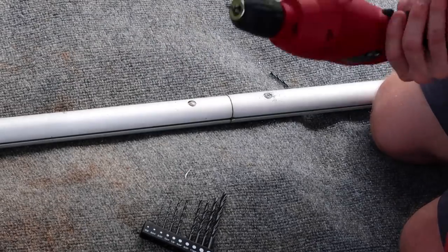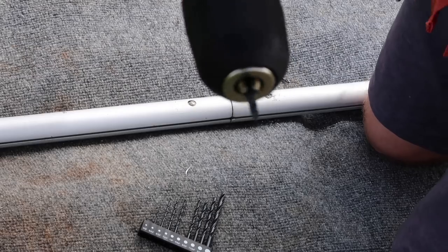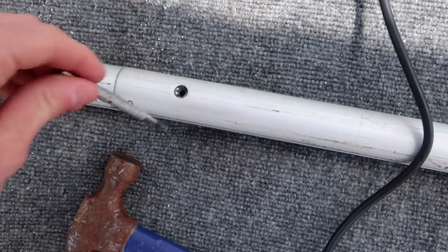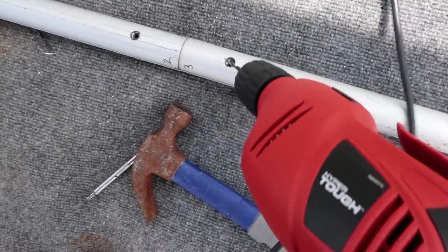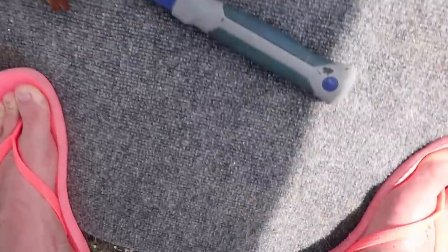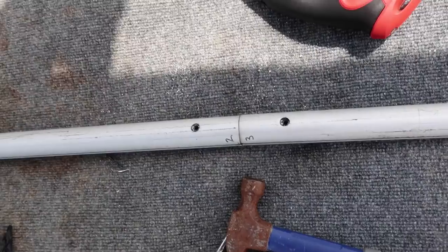Oh no! These are also hyper tough drill bits, by the way. I found a much easier way to get them off. You just take a punch, and then punch out the core so that the core goes down inside. You put a drill bit on the flange and drill it in there, and then it just kind of sticks to the drill, and then you just lift the flange right out. So it's really not a whole lot to getting them out using this method.